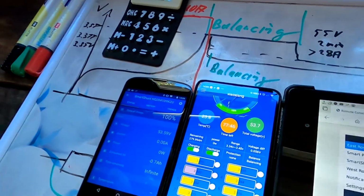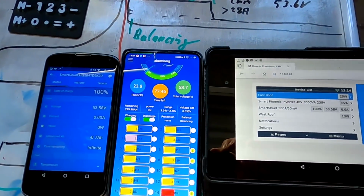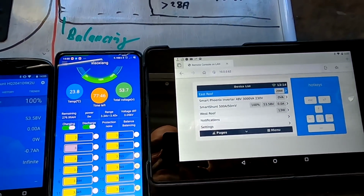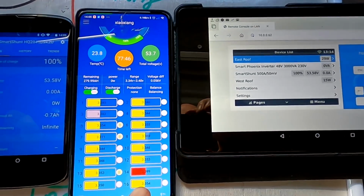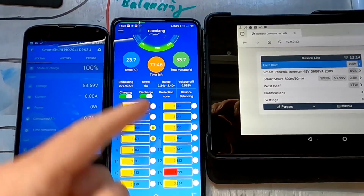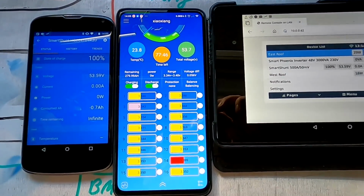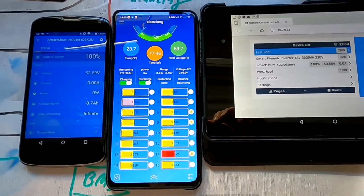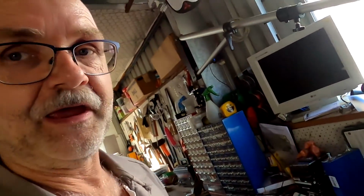So, well, for now, I leave the battery in float mode. There's not much power coming from the solar panels anymore. It's afternoon. And we will see. This one should come down now, should balance, and over time probably get back into the same voltage area as the other cells. I'm sure it will, but tomorrow we will have the same issue again. There's a new cycle starting tomorrow morning, and then it recharges the battery to 100% and the same shitty game starts again, right? So I'm not sure what will happen then.